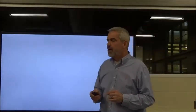All right. So before we go on, we talked about the disconnect and the short circuit protection in our system. What I'm doing now is breaking up the lectures into a couple of different videos so that it doesn't take quite as long to upload, and also to give you a little bit of a break in between. The next video that I want you to open and view is where we're going to cover overload protection, which is very different from short circuit. We're going to get those two separated to make sure you have a good understanding. And we're also going to talk about a manual motor starter. We're going to actually start getting the motor to run for us with the manual motor starter.